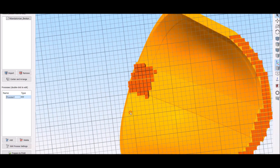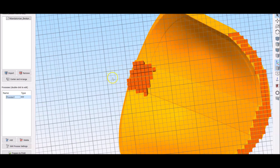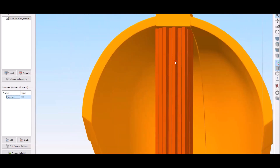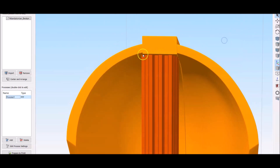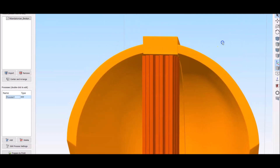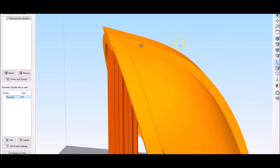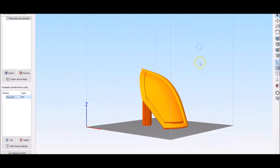Normally I would say it should be fine, but I don't want to take any chances on this one. See, it looks really, really flat — it's going to be a really bad overhang. So just add supports under there and that's it.